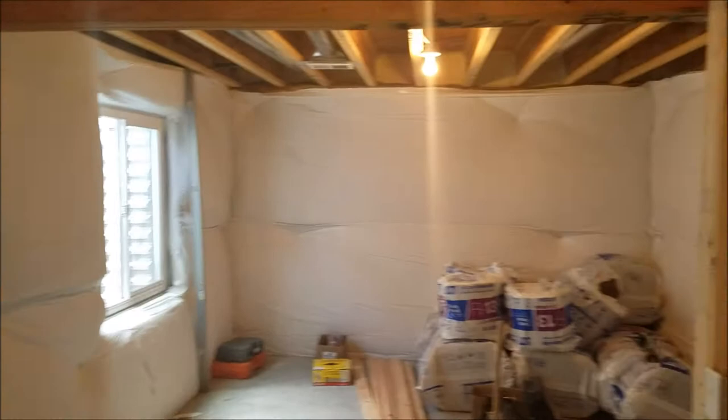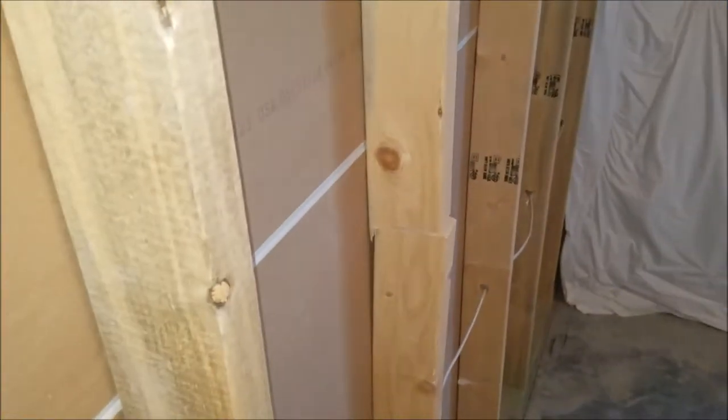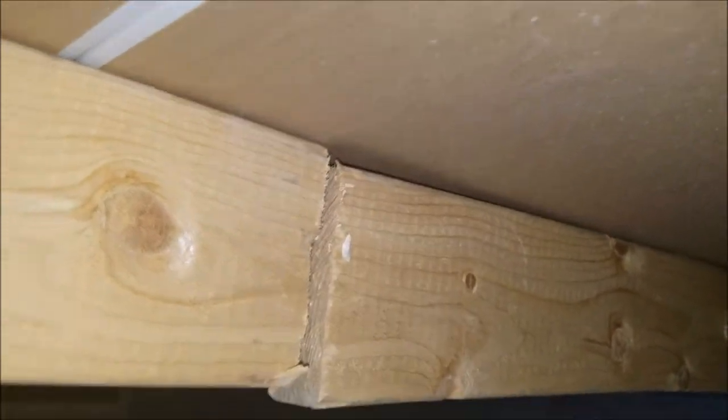Here's part of what they've already finished. They've framed the outside walls where you see that white padded insulation — it's going to get framed out with metal studs. See that stud? These studs have tremendous, terrible crowns in them. See how that's all crooked? That's why we go metal studs in basements. We don't like that kind of stuff — you can kind of see a gap there in the sheetrock.